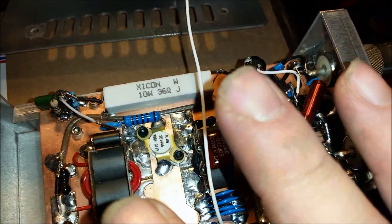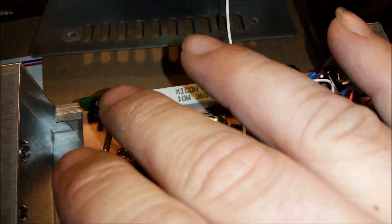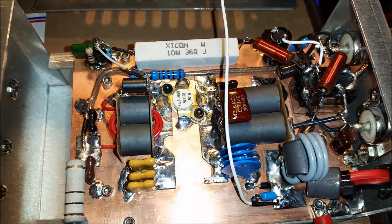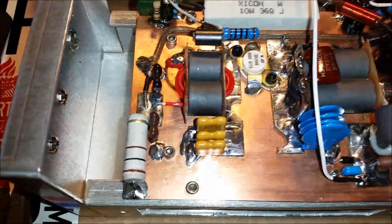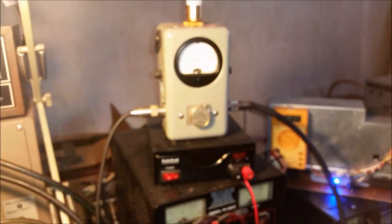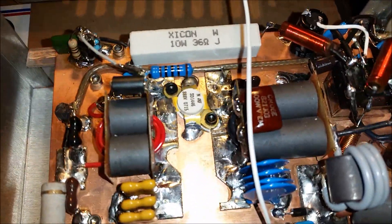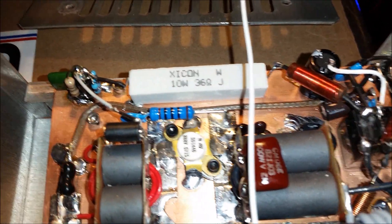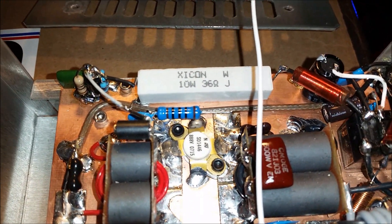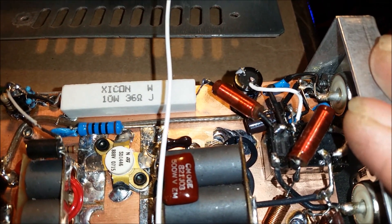Anybody with any electrical knowledge knows that DC voltage cannot flow through a capacitor in series — there's no electromagnetic flux there for it to pass through. This choke right here is soldered to the incoming RF coming from the input coax, and it flows through the sandbar resistor onto the AB bias circuit, which I had to customize a little bit. With these chokes, I had to readjust the biasing circuit because it was a little high — about 0.8 volts — and it was showing the difference on the bird meter. You don't want too much bias voltage going to the base of the transistors; that can cause problems quickly.